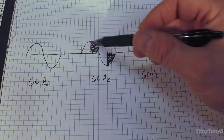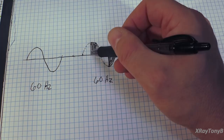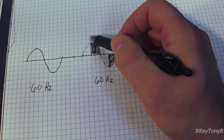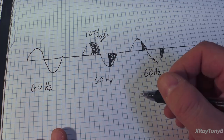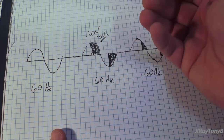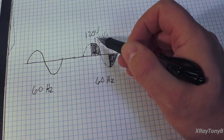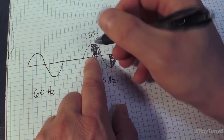Right at the time this sine wave hits its peak, in this particular instance, we are turning on the TRIAC. Because of that, your mains voltage coming in is sitting at its peak. At 120V RMS, that's going to be roughly 170 volts at that point, because RMS voltage is 0.707 of your peak voltage, and your peak voltage is 1.414 of your RMS voltage. So 120 times 1.414 comes out to around 170 volts. On the primary winding of that little transformer, you are seeing an instantaneous presentation of 170 volts.